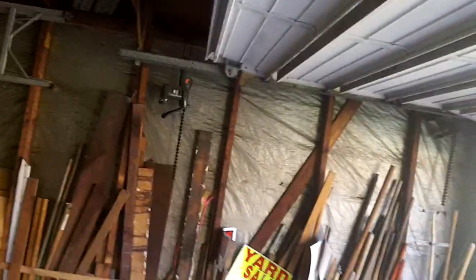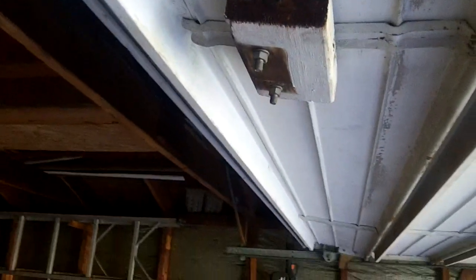Now the challenge on these was to adequately hook a door opener up. You can see here they might have possibly had one up here, but there's nothing in the middle here. So if you mount them to this or this, they just kind of fall through. What we have done, and I've seen done in the past, is an H-brace made out of angle and through-bolted through this. Or the alternative where someone takes a piece of three-quarter inch plywood, makes it about six feet, and through-bolts it.